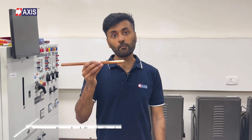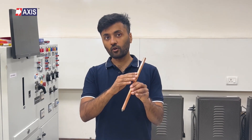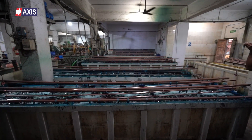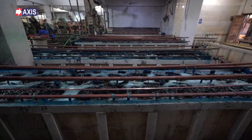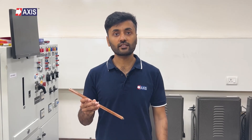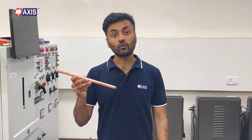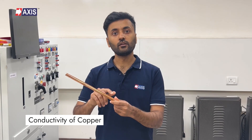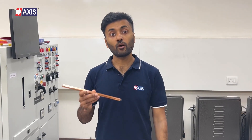Let's start with copper bonded earth rods. Copper bonded earth rods are the most popular type of earth rod across the world. A layer of copper is deposited onto a steel core using an electroplating process. This molecular bond of copper with steel prevents it from slipping or tearing when driven into the ground. Compared to solid copper rods, these are cost-effective while still providing low electrical resistance and corrosion resistance. These rods combine the high tensile strength of steel along with the conductivity of copper, making them economically efficient and a popular choice across the globe.